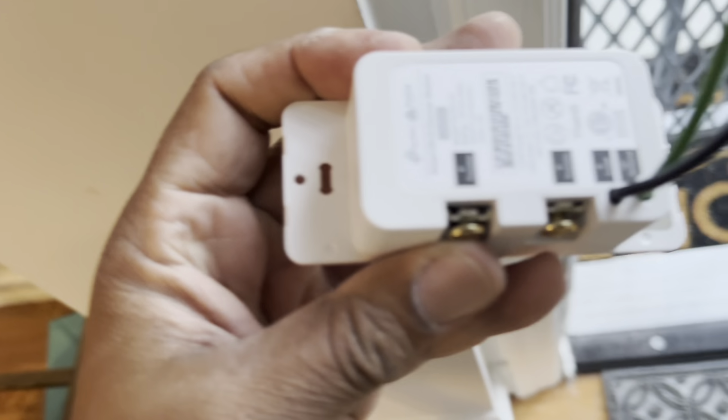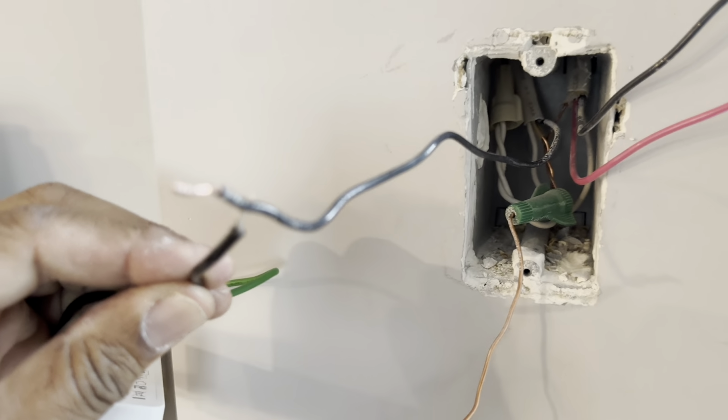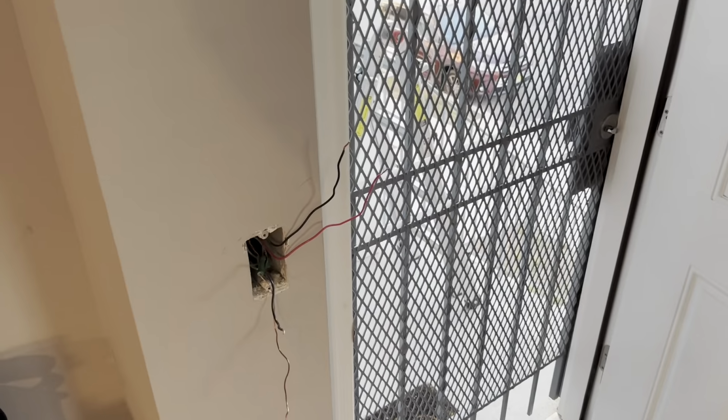So you know this is going to go on the travel side, because they're together within the same casing. You've got the two travel wires there, and this is the travel side right here. With this particular switch, this is how it's set up. You've got the travel here and your travel here, so both of them plug into here. Then you take a wire nut and hook up your main line, the one by itself, which is the load line. You hook that up with a wire nut, and then your ground wire you hook up to the ground. I'm about to put the camera back up there and hook it up so you can see. It's super easy. You cut the power. I told you I was working with it on because I needed a little light.